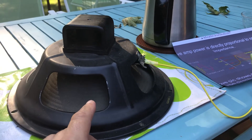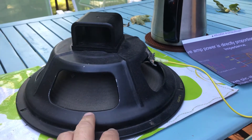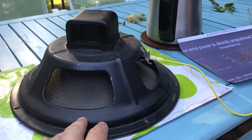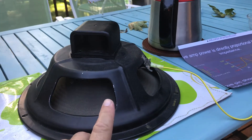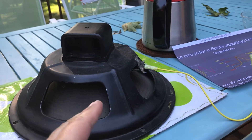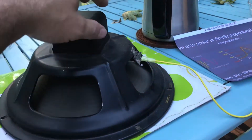The output on a solid state typically imparts zero impedance to the speaker — the speaker sees a zero impedance load, as if you shorted the two terminals. Amplifiers like Fender and Marshall are not over-damped by any means, but because they have negative feedback there is some damping, though nothing like a typical solid state amplifier which is essentially 100% over-damped, unless engineers tweak the output section, which isn't common.